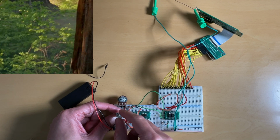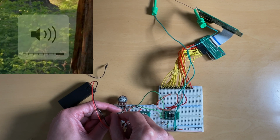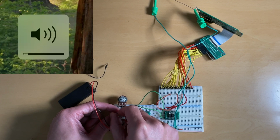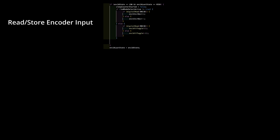With normal use, it's perfectly fine, but going back to that jerk with anger issues, if you did flick the encoder extremely fast, you could get it to trigger key presses too fast, and then you would miss some key presses. But again, you'd have to really be trying to intentionally do that. With normal use, you wouldn't see that. But that would have been a compromise, and then you'd have to deal with that jerk in the YouTube comments saying how my stuff can't handle the spins. But now with an Arduino, we don't have to deal with that. We can guarantee that every detent pulse is sent over and registered on your computer.